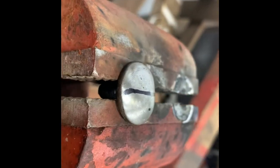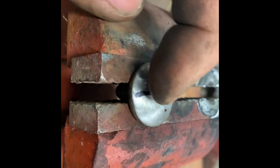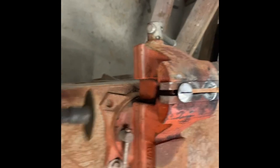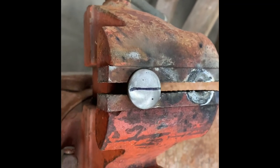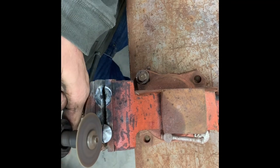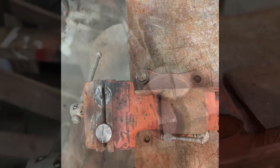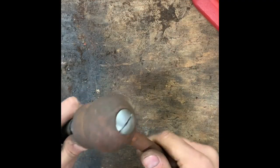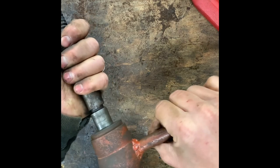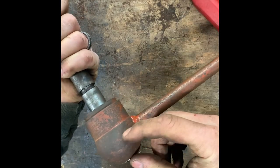Here's what we're at so far — I got the head polished down pretty good. I'm going to hit it with the buffing wheel once I cut the screwdriver slot in it. I kind of got it roughly marked out and I'll use this to get a rough line, then maybe a hacksaw blade. Here's that custom screw I made — I put the spring in behind it. See, right now it's locked in, so you tighten your vice down and your handle's kind of in the way, so you pull out and you can adjust the handle. You let go and that spring engages it.